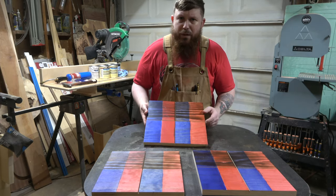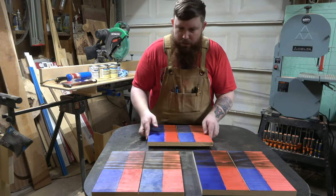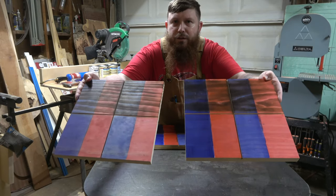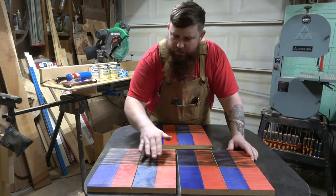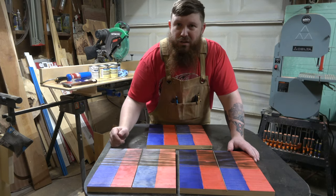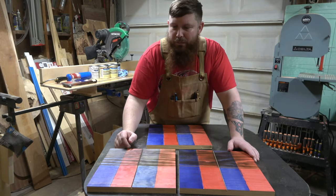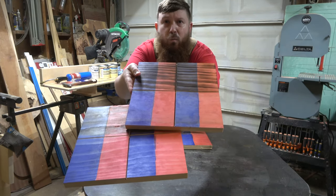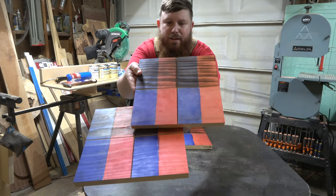As far as the areas that we did wipe the excess off on, I'm not noticing a huge difference between the three of them. Comparing the two you can actually get now — the Varathane and the new Minwax — the only thing I'm noticing is that because the Varathane was thinner, it's just a little lighter. So if you wiped it off, you'd probably need another coat. It's actually very close between the wiped-off Minwax and the not-wiped-off Varathane side.